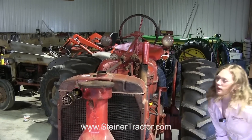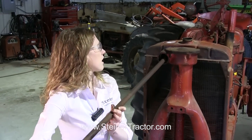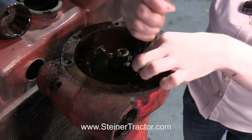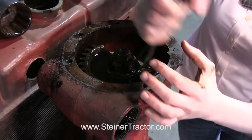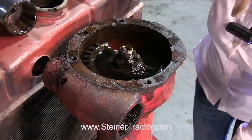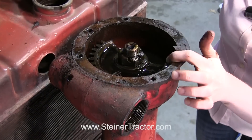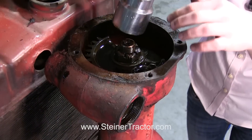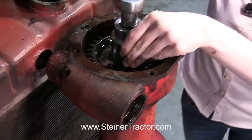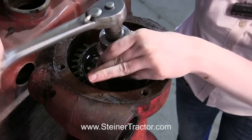I'm going to step around to the front and pull it out the rest of the way — just like that. I'm going to remove this cotter pin and pull that out. Then we're going to use a socket on the end to bring this nut up. You can see that in this tractor we have just a half moon style gear, which is original to the tractor — what they came with. This is a 39M, so that's what it would come with originally.